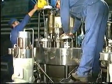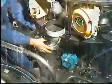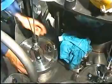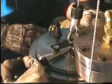Place the spacer ring in such a position that the Tommy bar for tightening the nut can be applied through the slot. Press the piston and cylinder of the jack firmly together.